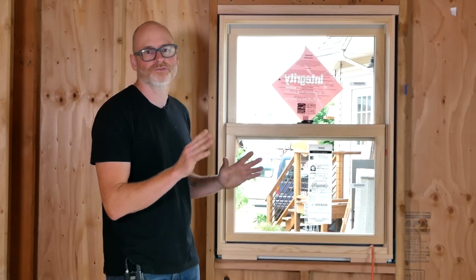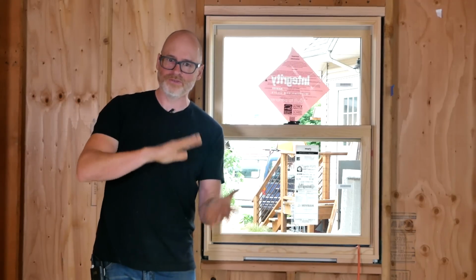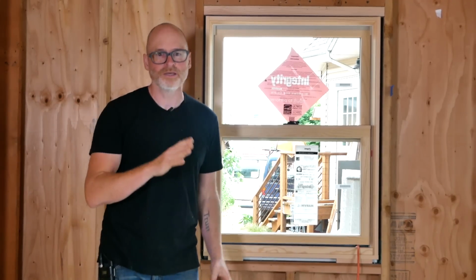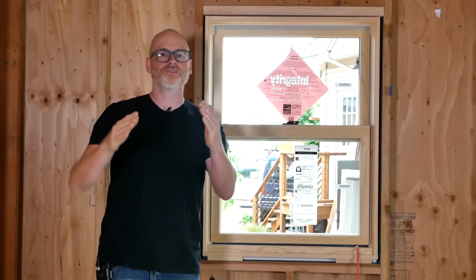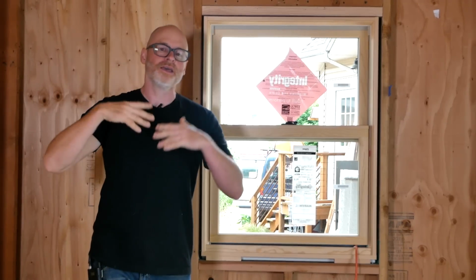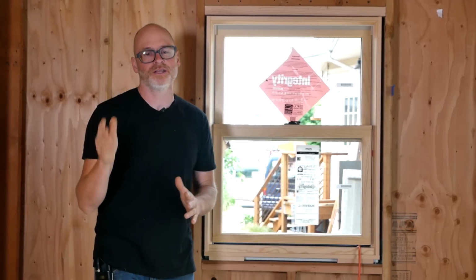All right, so now we're getting into the fun stuff here, the stuff I really wanted to talk about in this video, which is how to minimize the framing around your openings so you can decrease your thermal bridging, leave more room for insulation, and also make your tiny house a little bit lighter at the same time. Now, typically what I see in tiny house builds is people copying the same door and window framing arrangements as you see in residential construction with your king studs and your jack studs and a big old header there. And most of the time, that is unnecessary for a tiny house.